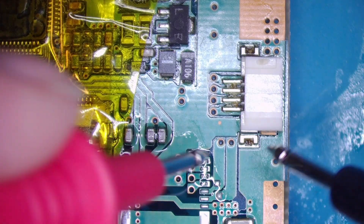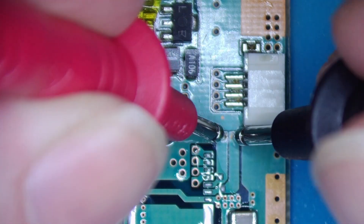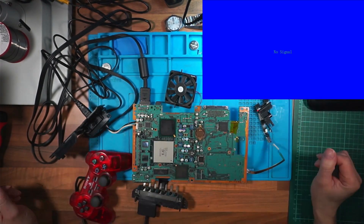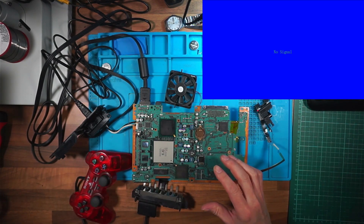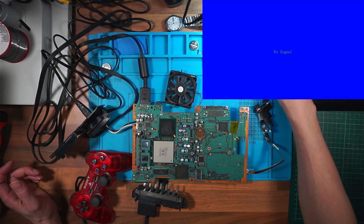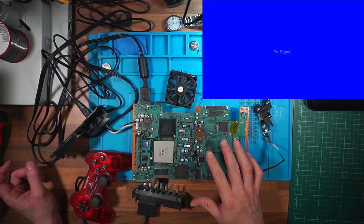I should have made a note of which way the chip came off. I think that chip is okay - that fuse is definitely blown, the capacitor seems okay, but there's another short somewhere else. With the chip off, these were shorted - and they're not shorted - so it must be the chip. Those two pins - this one and this one - yeah, so that chip must be faulty. I've got a short circuit on this chip; I've taken the chip off and the short circuit's gone.